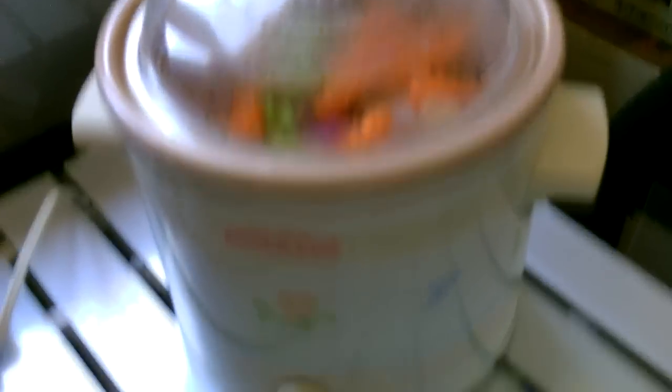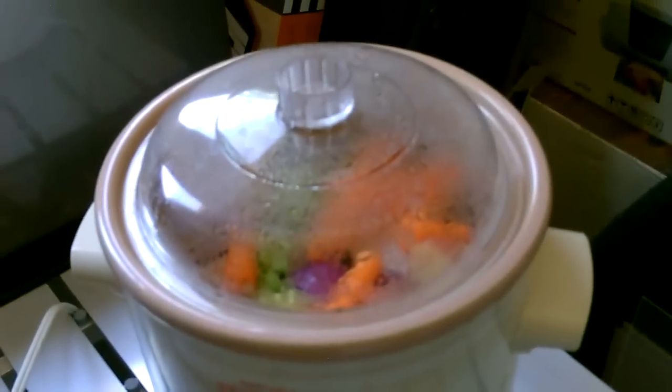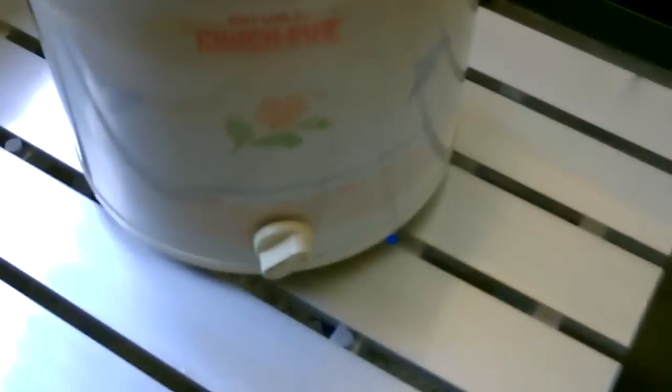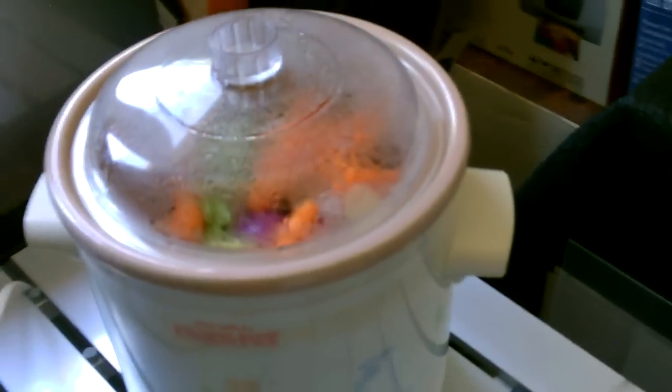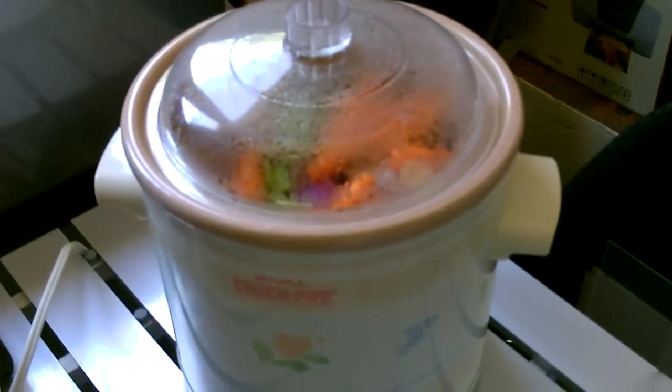Just a quick note about cooking on battery banks — this is the best way I've found to do it because it doesn't pull that many watts per hour. On low it's like 60 watts, high 90. So two batteries can easily handle 90 — that's like 45 watts of battery draw. Not bad, especially when you've got 90 watts coming in.